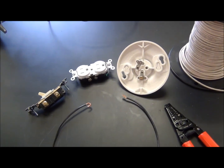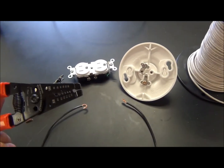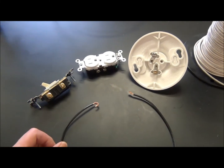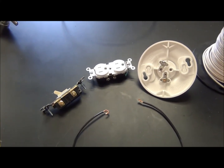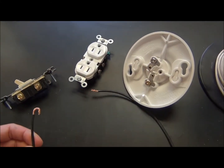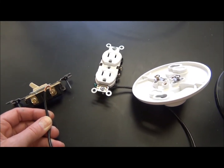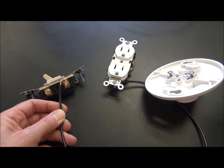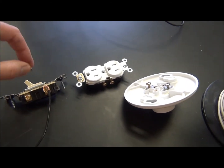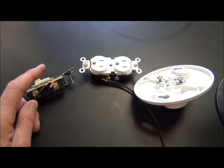To make the proper connection, we're going to take the piece of wire that's had insulation stripped back about three-quarters of an inch. We'll use the long-nose end of our wire strippers to make a U-shaped or half-moon-shaped curve in the wire. There is a right and wrong way to attach this to our switch, outlet, or bulb base. We want the opening of the crescent moon to be on the right-hand side, because when you tighten the screw clockwise — righty tighty, lefty loosey — the wire won't come off. Going the other direction would result in a loose, less conductive connection.